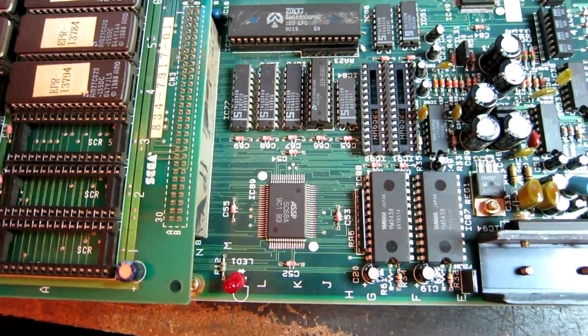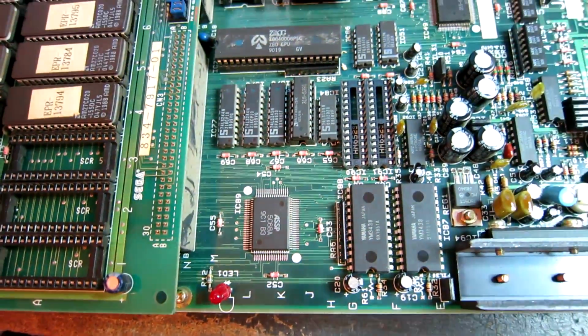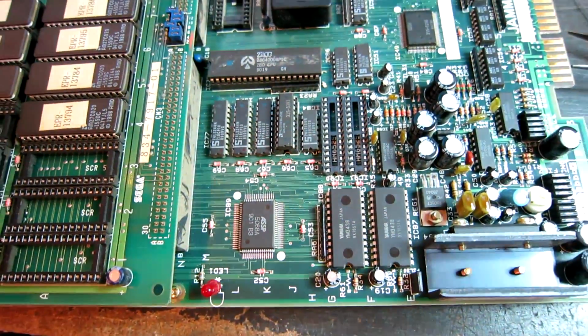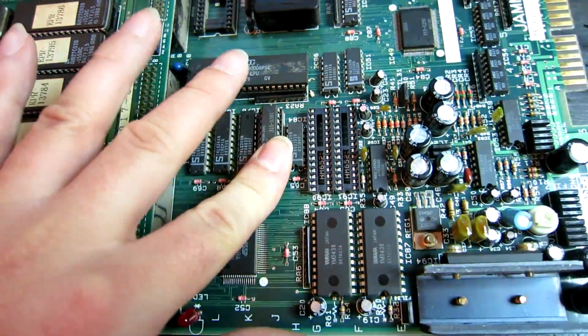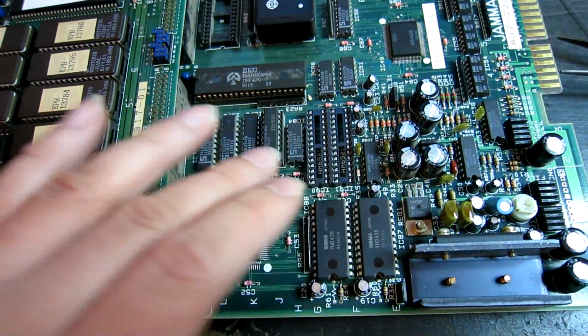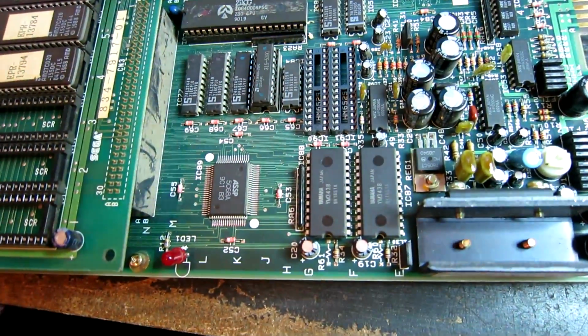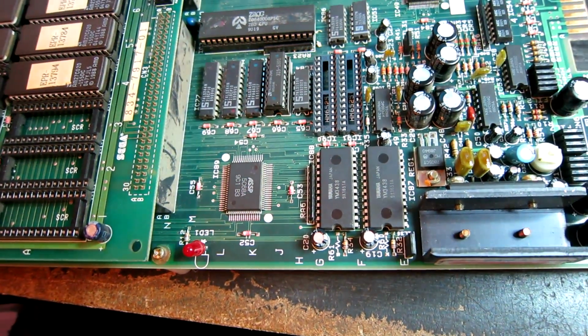Okay, so today I'm looking at a System 18 Sega board. This one is Shadow Dancer, and this one has no sound. I've already verified that the Z80 is good and also the PAL is good. A common fault can be the RAMs here failing, so I've basically desoldered those, put some new sockets in, and I'm just about to go and test these in my logic tester to see if they're good or not.